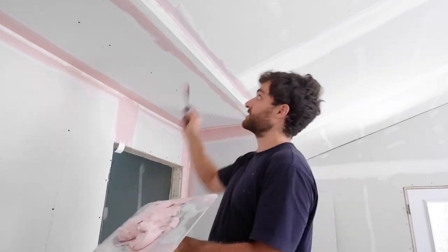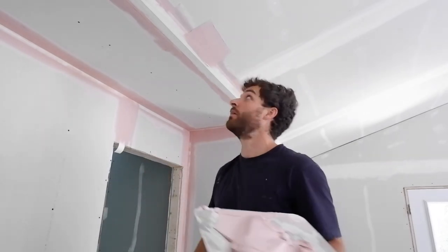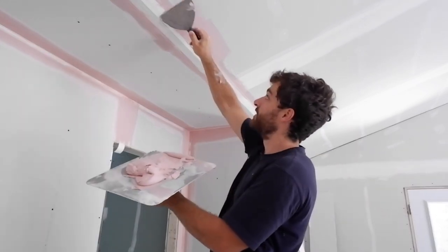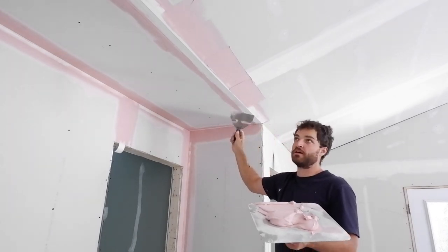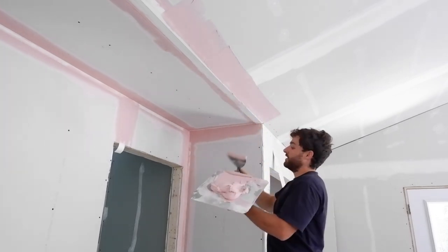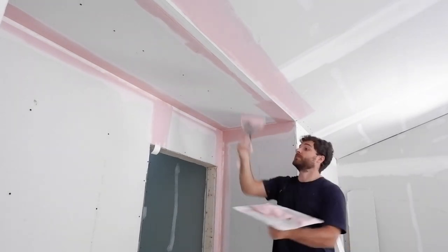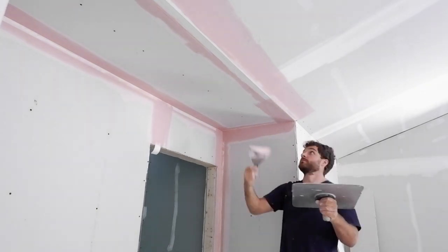With this product it's designed to do your second coat right away. I've upgraded my knife to a wider blade — this is a five inch opposed to a four — and I'm going to run it just like so, not going right to the peak. It says it on the box, just the required application they suggest basically looks like this. Make sure you drop lots of mud on you — it's good for the skin, actually it's not, it dries it out. I'm still making sure that there's daylight coming in between my knife because I can still wiggle that corner bead, but after this dries you won't be able to correct it. So I put it on, pull it straight, and do the other side right away too.